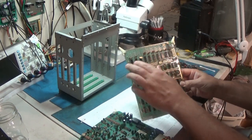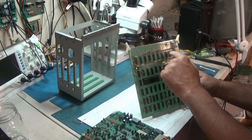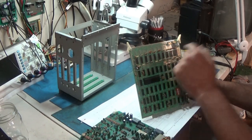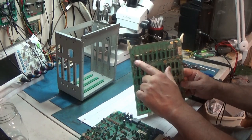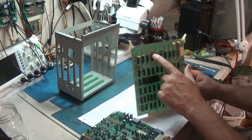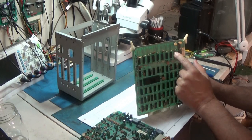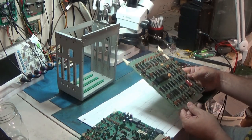So it looks like we have 8-bit RAM right here, and then we have three more bits here that are probably separate for something. I would say, because these are a faster speed RAM, the 4116s are definitely a different speed, so this is probably your 8-bit video, scratch RAM, kind of a la Missile Command. Missile Command uses 8 of these as well. So these are probably scratch RAM or something like that, these three. I would imagine.